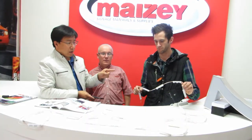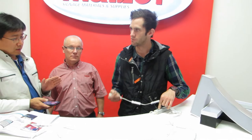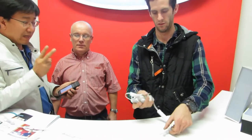Now what we're going to do is hook up a shorter row of LEDs, and then hopefully the LEDs won't flicker. We calculate from the transformer. A 20-watt transformer — less 30% divided — gives us 14 watts. So 14 watts divided by 1.2 is 11.6. Make it only 11 modules. Let's see what happens.